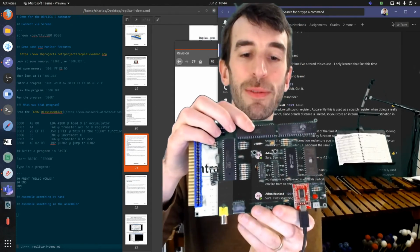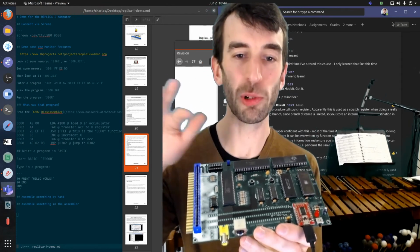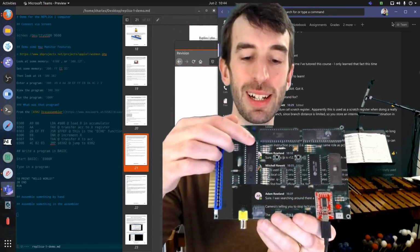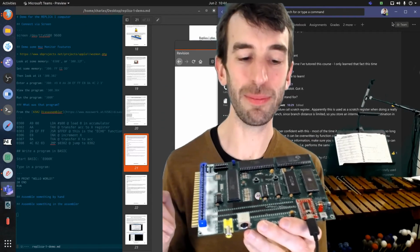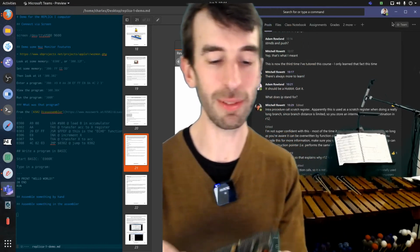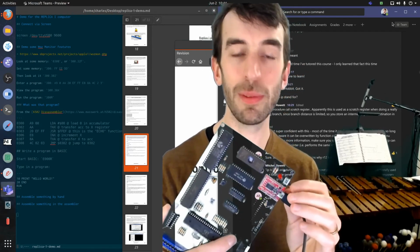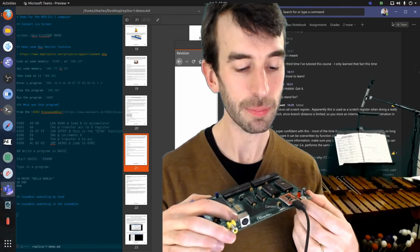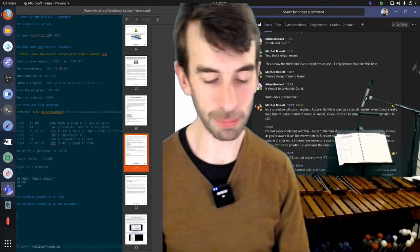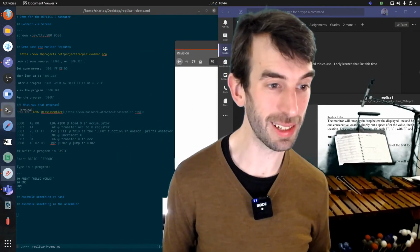And this chip here is for giving you two peripheral inputs and outputs, switching between them. It's called a peripheral interface adapter. And then this parallax processor helps manage the serial input, output. It does a video signal, which I never use, and handles keyboard input, which I never use. The way I use this computer is just to connect to it over serial with this USB to serial UART adapter. So I'll just turn it on, and then we'll have a go at running a little program on the 6502, which I think is just for interest's sake is cool.